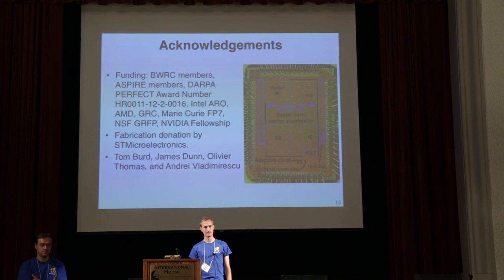To make it work, you need something between the synchronous domains where you talk to serial links to the outside world and your internal stuff. How big is the FIFO and does the latency cause overall performance problems, since it takes longer to get on and off chip than in a fully synchronous system? This system only has a level one cache and no DDR connection, so the on-chip to off-chip communication latency is already huge, making the asynchronous FIFO boundary not very noticeable. In future designs there will be a level two cache and ideally DDR. At that point there will be certain latency costs to separating the L1 and L2 voltages, but if it becomes an issue you just extend the voltage boundary further down the memory hierarchy to hide the latency.